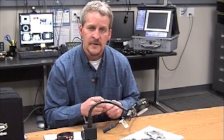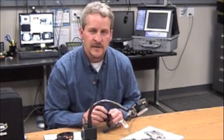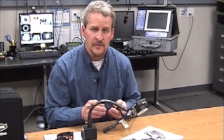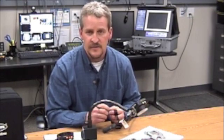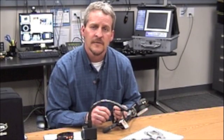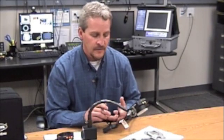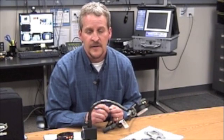What I'd like to do now is talk about some of the features and benefits. The system is a nice compact unit with a screen on the back. The camera resolution is 752 by 480 pixels, so you get a really sharp image, which is unusual for a small system like this. The speed is very quick — exposure times I was testing were at 28 milliseconds, meaning it takes the acquisition and does pattern matching all within 28 milliseconds. It can also handle 360-degree rotation if your part is rotating.